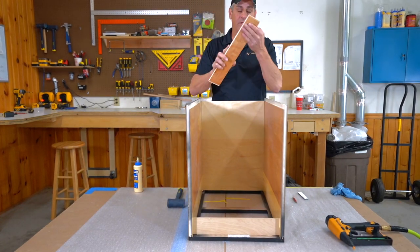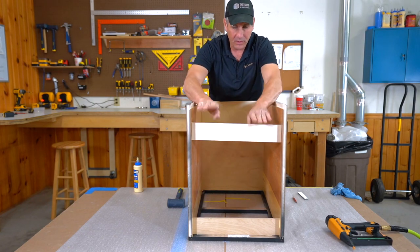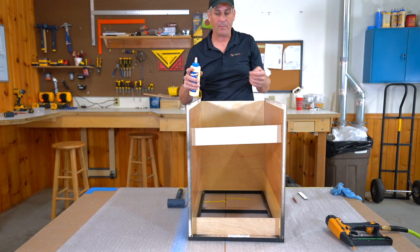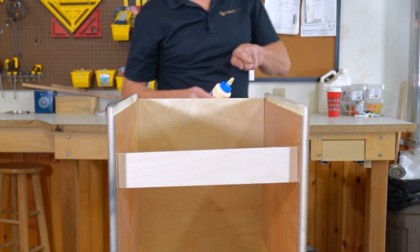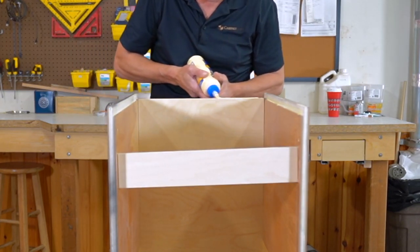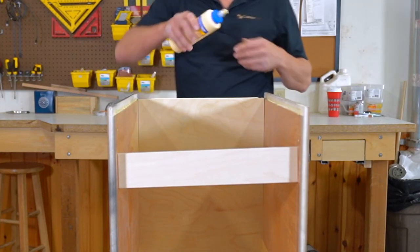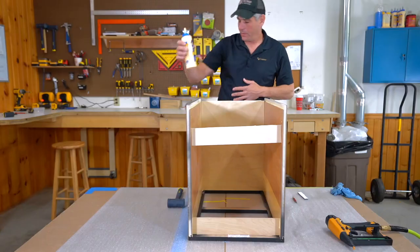Take the final spreader strip — finish side in — and run it down a couple inches without glue first. Then apply glue, because when you press this up into the cabinet back the glue will spread out. Glue the vertical surface, not the horizontal one; you want the unfinished cabinet edge to contact unfinished cabinet side material for a better glue bond.